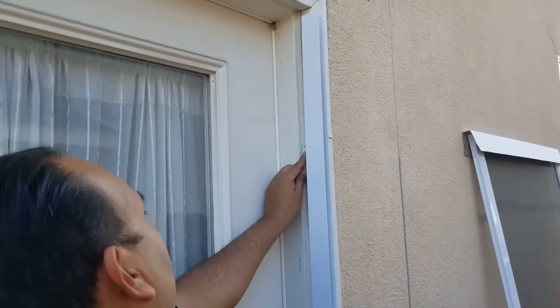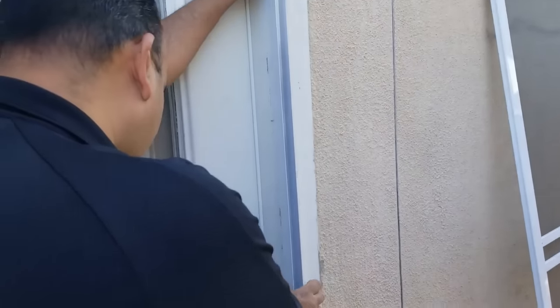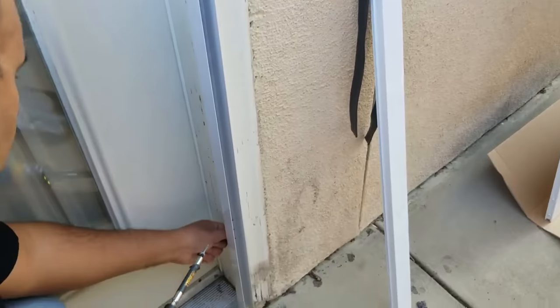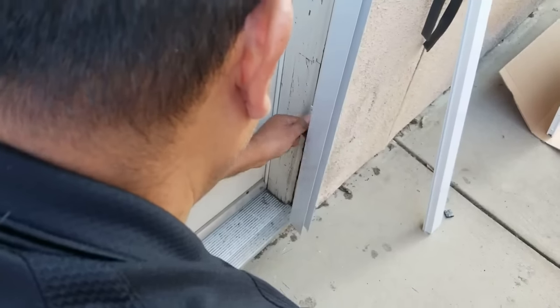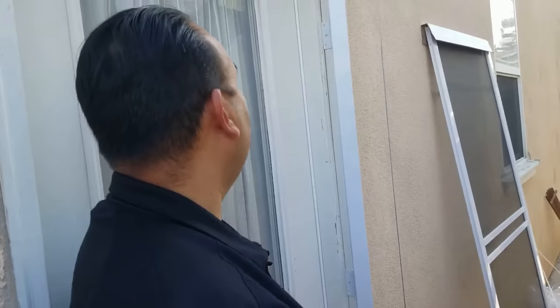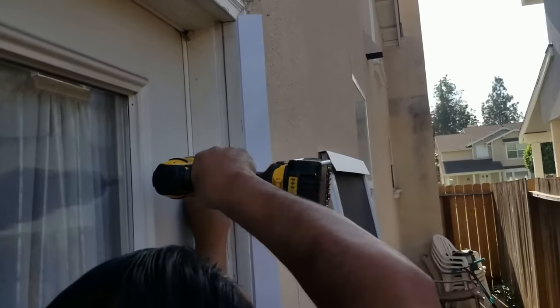What we're going to do is make sure there's enough space at top and bottom. This fits. I used to do one top, one bottom, one middle. At first I'll usually put just one screw on each hinge to make sure everything's working. So that all works good — then I'm going to put the rest of the screws in.